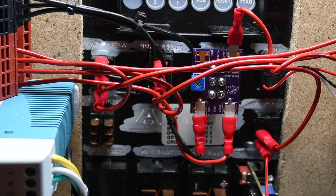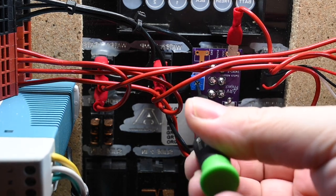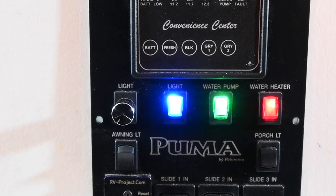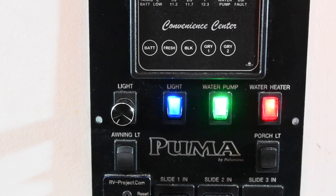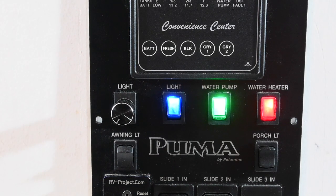With the circuit board installed on the mock-up, we can insert a small screwdriver and adjust the potentiometer — and now there's bright and there's dim. If that is not dim enough for you, you can always go up to a 20K ohm resistor. I hope you find this project easy to do; simple little things like this can make all the difference in the world in your RV.